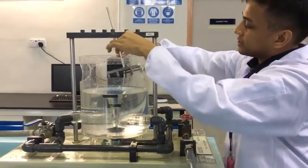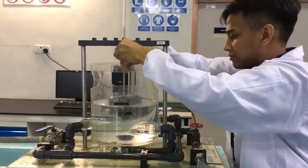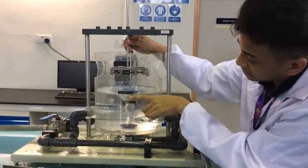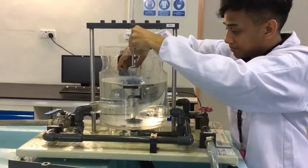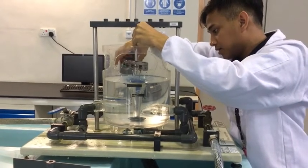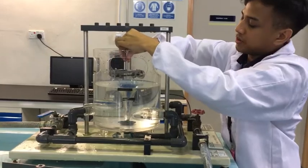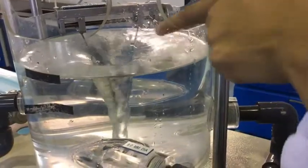Put the profile measuring gauge in from here, all the way to the center. That's going to disrupt the shape, but wait for the water to return to its original level. Once it's right, turn this around until it touches both ends of the circle — you can see that's the diameter of the circle, touching the water.